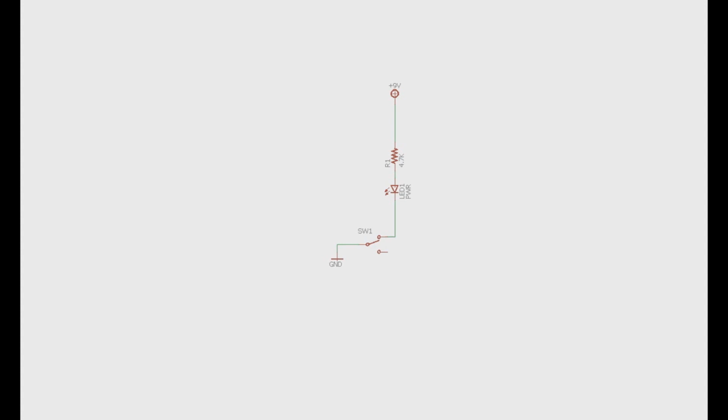This typically happens if your power supply feeding all your pedals doesn't have enough bulk capacitance to feed your pedal and your LED. Though there are several ways you can fix this issue, and I'll have some circuit examples with links in the description below, they typically come back to the idea of making the LED draw the least amount of current possible so that the incoming current rush is very little.